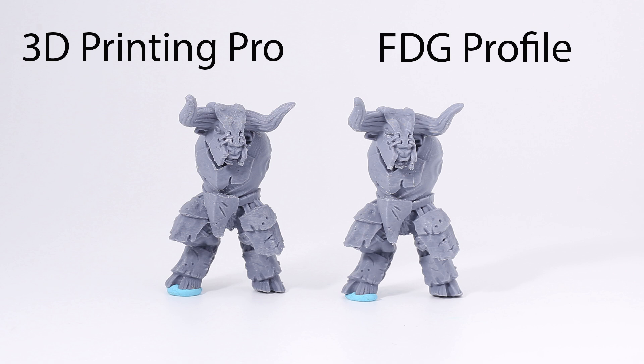Zooming all the way in, mine is on the left, FDG on the right. In the mouth area mine came out a little better; on the horns there are mixed results — top side mine wasn't as good, but the bottom side FDG didn't come out as well. Even if you consider them dead equal, mine prints at 0.08 millimeter layer height 30 percent faster. If you change the settings to 0.1 for equal layer heights, the minotaur in my profile only takes five hours — saving four hours on that print. The speed difference is incredible.